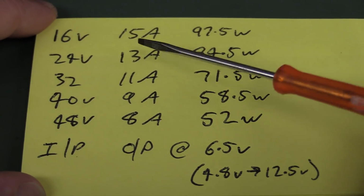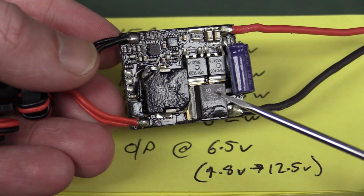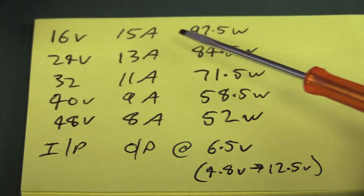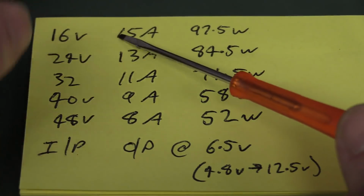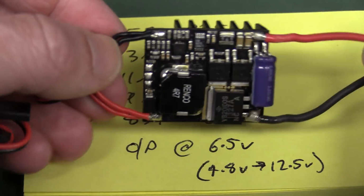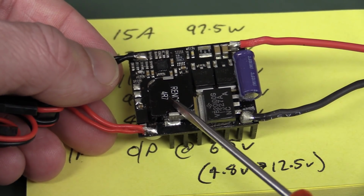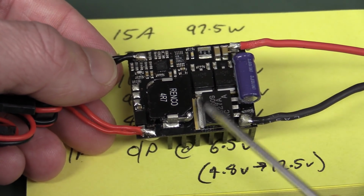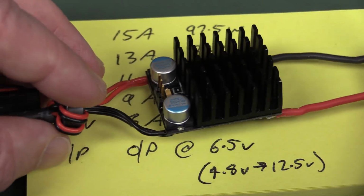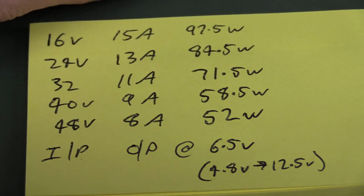This is a DC to DC converter, of course, and it's going to have an efficiency of at best 90% for one of these particular things. They would have designed it for one particular output current, because you can design DC to DC converters with 90% plus efficiency if you choose the correct type of magnetics, i.e. the inductor here, that's what this big device is, the MOSFET, the output capacitance, and the switching frequency, and you can actually design it for quite reasonable efficiency.